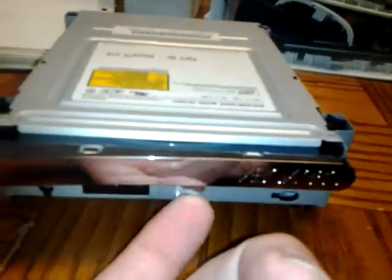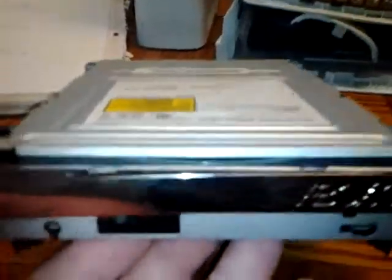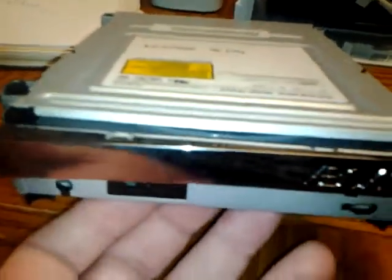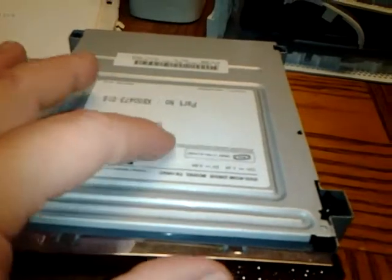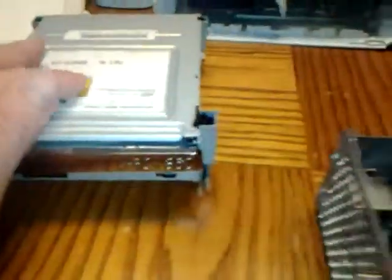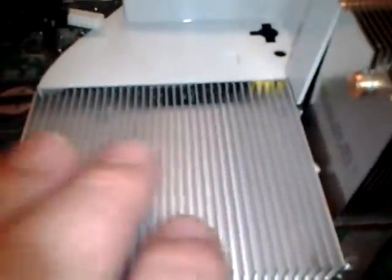You'll have a piece of tape — it's like a seal — just go ahead and break it. You don't want to blow any dust into this because there are two really strong magnets in there, and if there are any metal particles in the dust, they'll get sucked straight into the laser. What happens is the face of these units gets clogged up with dust where it sucks the air through, and you'll get a coating of dust on it.